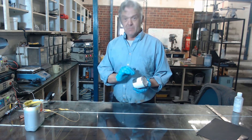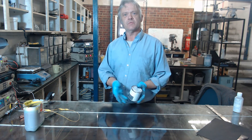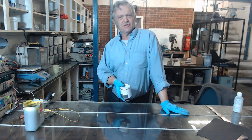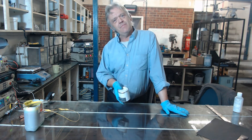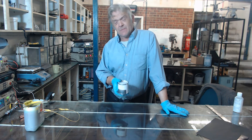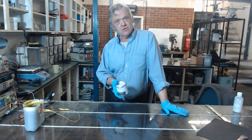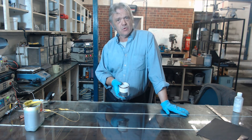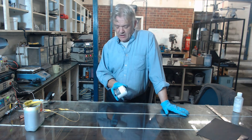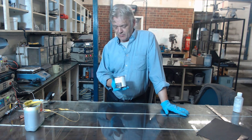The ink is a mixture of graphite and graphene. We could have made it all from graphene but it would have been stupid money — something like a thousand pounds a litre, just ridiculous. So we mixed in the graphite to keep the price down. It's exceptionally well priced with exceptional conductivity — 0.8 ohms per square per mil is really quite exceptional. You'll find it for sale in the shop if you want to buy some.